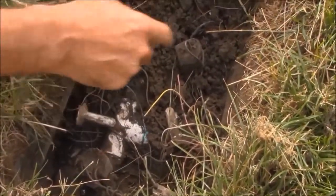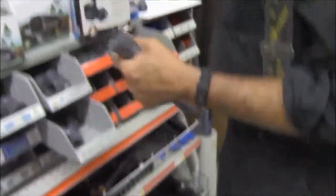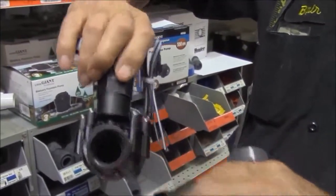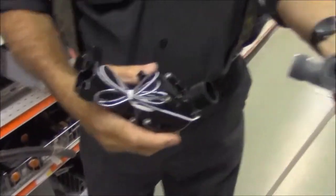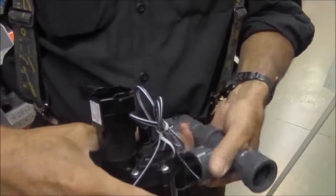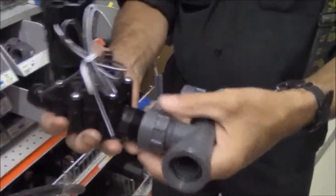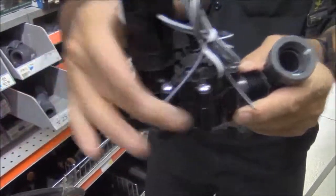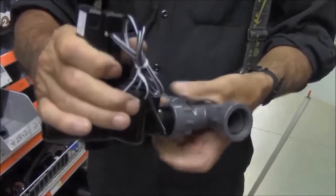The new system uses T-fittings with O-ring seals that screw together, and valves that are pipe-in, pipe-out. One-inch threaded national pipe thread is the standard size — you can screw in PVC, copper, anything you want. With this modular system, if you need to repair or change a valve later, you just undo the nut, pull it up, heat the rubber tube a little with a torch, pull the valve out, and replace it. Because you have a union, it's easy.